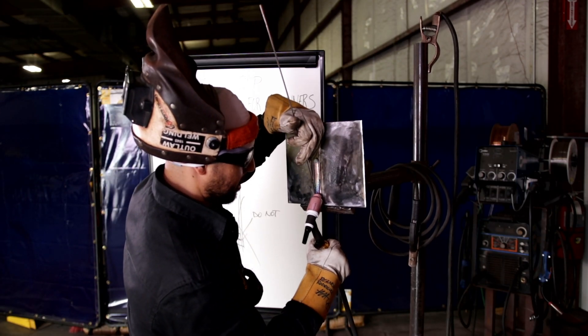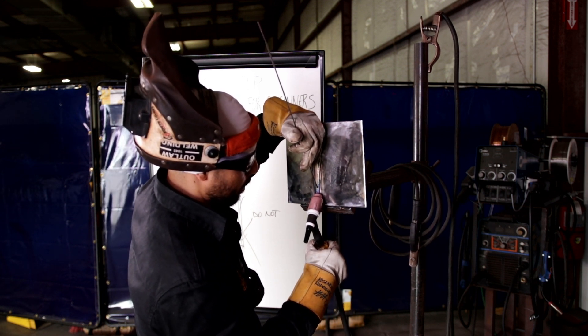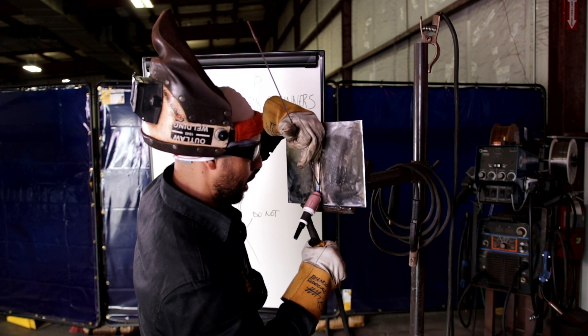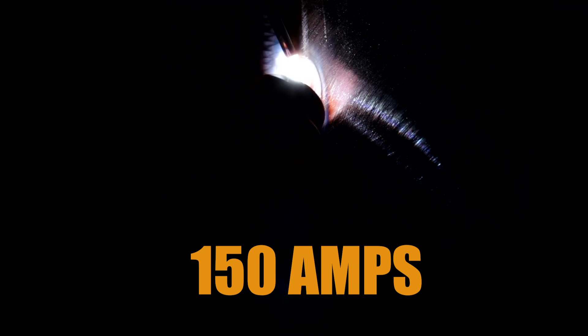Right now we're about to start our next bead. What I want you to do is keep your tungsten about an eighth of an inch away from the edge of the first cap — the first bead. That's going to allow you to overlap this cap right here, this bead. So an eighth away from this bead. Here we go, so we're starting now. Remember, you want to arc about an eighth away from that bead. My temperature right now is about 150 — don't be afraid to turn it up or turn it down. Get comfortable with a temperature. My temperature is 150 right now.